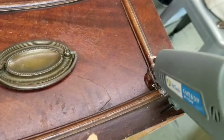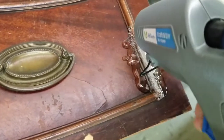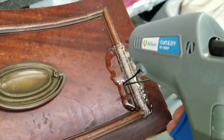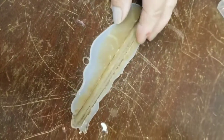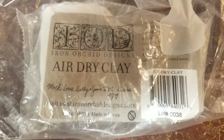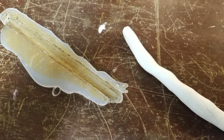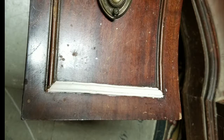When a piece is missing the molding, you go to another drawer that has a good side of the molding and I'm just applying hot glue on there — it really won't damage the piece. I'm going to paint it anyway, but I covered it completely and let it dry overnight. Here's what you end up with: it's just a mold, and I used Iron Orchid Designs air dry clay to fill the mold. I rolled it and pressed it in the mold — I made a spaghetti string if you will — and when it comes out it looks like this. Nice mitered edges, and you just glue it into place with some wood glue, let that dry, and you have a replaced molding.